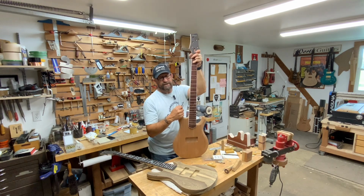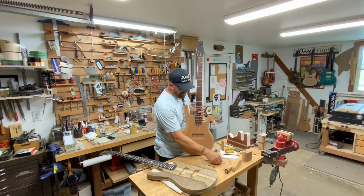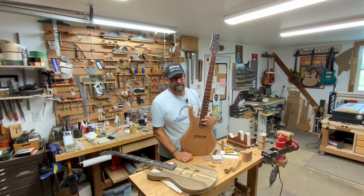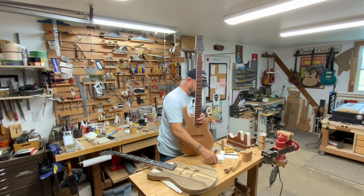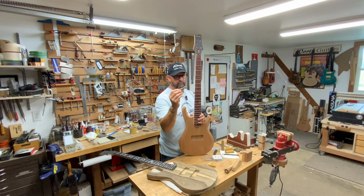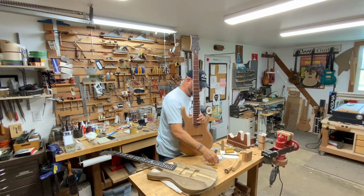So at that point, as you can imagine, I was starting to get a little irritated. And so I had to stop and run over to Tractor Supply and I bought this rig here. And man, this works. So, in conclusion, after all of that, if you want to do threaded inserts, you can do them on the drill press. It works great. You just need to make sure you get one of these screws with the Allen wrench socket in the head and use an Allen wrench just like this on a bit holder just like this in the drill press. Then you can use the drill press to help you drive it down in.